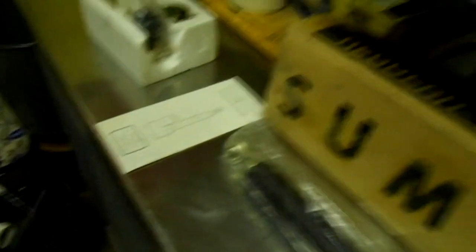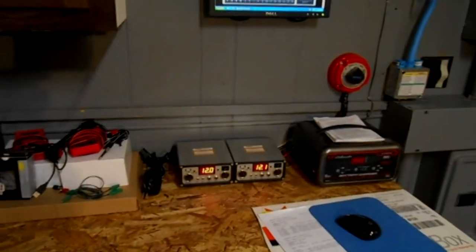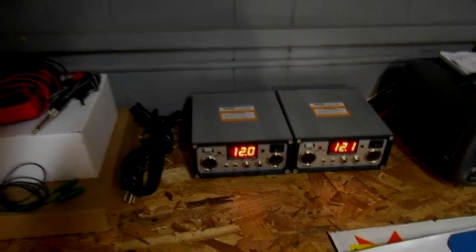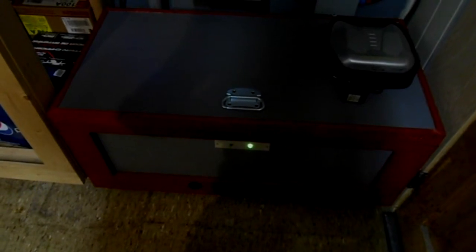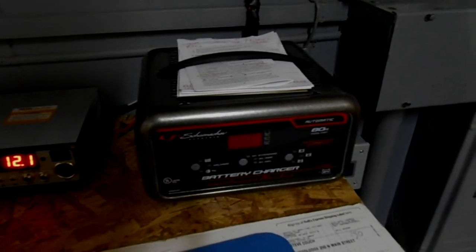Okay, let's get started on my power wall and we'll talk about the power that we use. The wires from the solar panels come into this area — this is like a utility room that's off our main building in the back that has all our systems in it. The wire comes in here and into these charge controllers from the solar panels, then it drops down into these boxes, and then into this battery box that can hold six deep-cycle golf cart batteries that are six volts each.